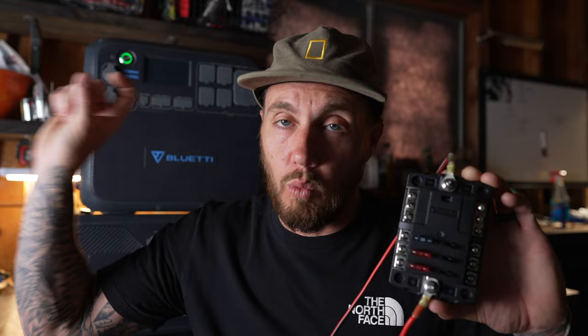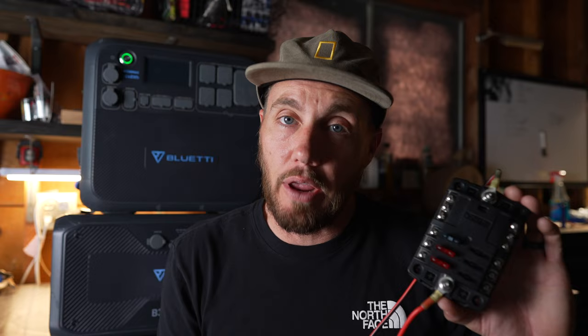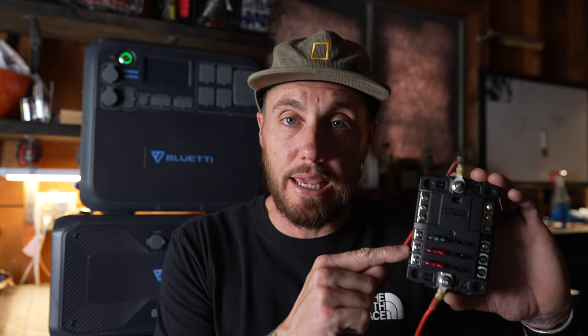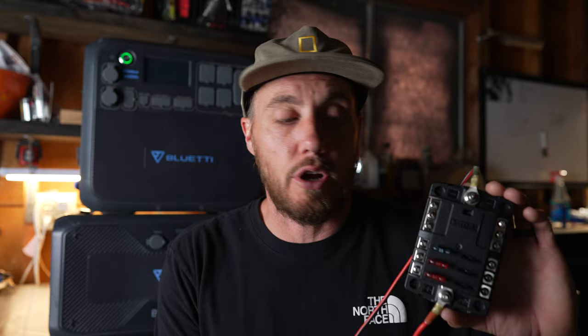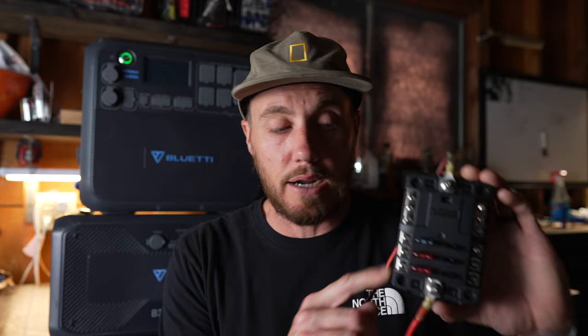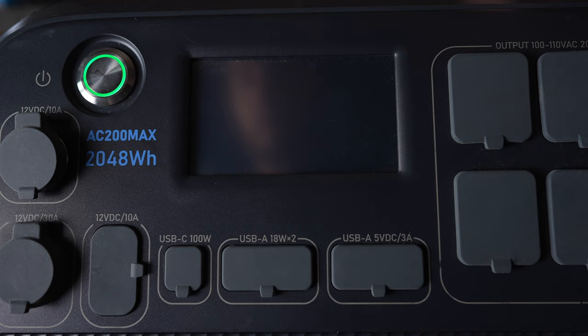If it's a light, I would recommend using a smaller gauge wire because DC powered lights do not require very much power. Now, if you're powering your fan, depending upon the distance of how far your fan or your component is from your fuse box — because you do lose power the further the distance — you may need to up the gauge of wire. Do some research on that depending upon how many feet your component is from your fuse box. Once you have your power connected and your ground connected, and this is connected to your AC200 Max via the aviation plug, turn it on, press this, turn your DC on — your DC is on and it is pushing 30 amps to this.